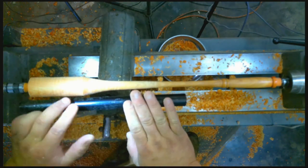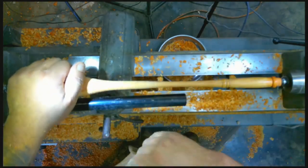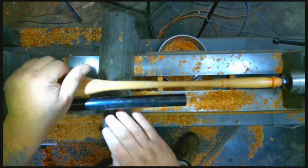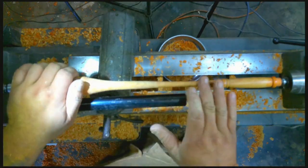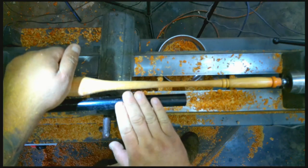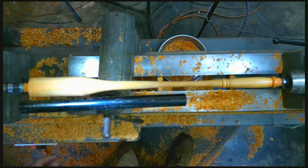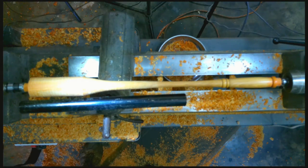in order to counteract the strange twist and slight angle to the grain. It's not cut directly straight grain. And so that's why I think we're having the challenges we are with the grain picking and catching. It's not tool catches, it's actually the grain itself lifting up and catching. So hopefully that counteracts that grain.